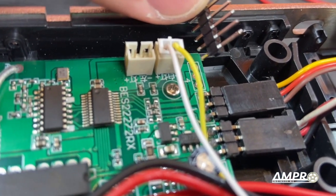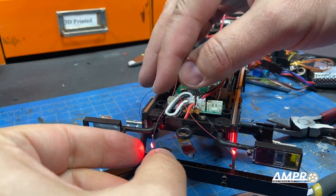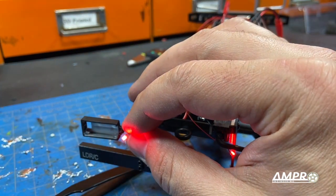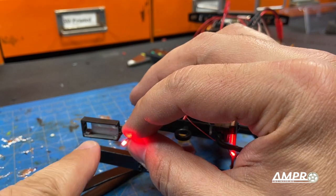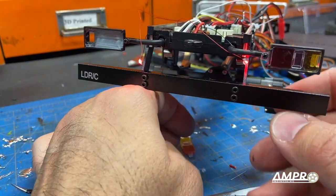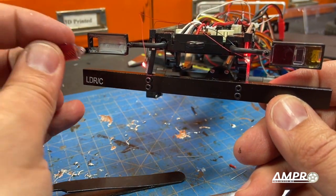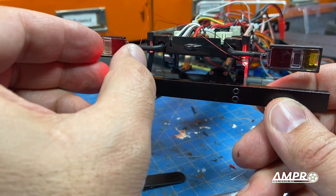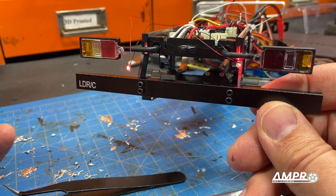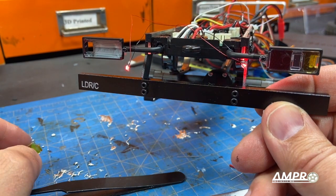Oh, that's outstanding. I made a couple wiring harnesses and they're kind of complicated because I wanted these little tiny, I think these are like 2x4 or 2x3, SMT LEDs, and we're going to shove those in here. What I did, which is probably the only thing that makes sense here, you can see how dark that one is there. That one has its original housing that's just the injection molded black plastic. This one here, if we kind of just shove it near there, you're going to see the difference. Honestly, whether or not you put lights in here, just taking a silver paint pen and just painting that in there, what a monumental difference.